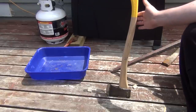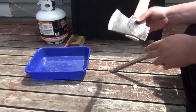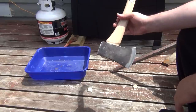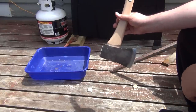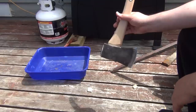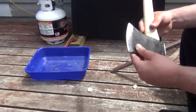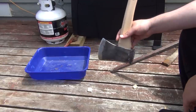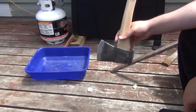This is one of the axes that I re-hafted. Cleaned up the bit, took most of the rust off, ground back the pole a little bit. Split the underside to remove most of the flays, the burrs, and the little splits. I left the edge with a relatively thick and pronounced secondary bevel of around 25 degrees per side.